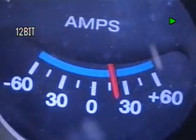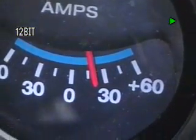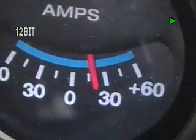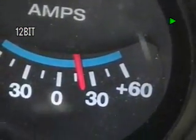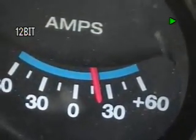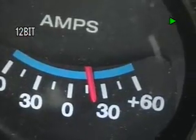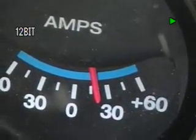We're air cooling this unit. If we cool it down, we can use more amps, we don't have an overheating problem, and we can get more HHO. Where we used to run these units — as you look at the amp meter — we used to run the unit with a 4 to 8 amp charge, and they would run up to around 12 amps. At 15 amps they were boiling. Now with the air cool, we charge it about 8 amps, then let it run, and we're now running 18 to 22 amps — and no longer is it boiling.